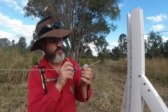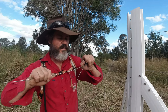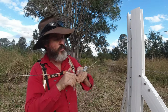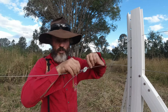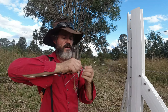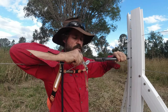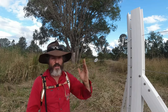To undo that now — like I said, there's three holes: two the wire goes through, and one for the key. You merely push the key all the way in, hold this wire, and the wire comes out. If the wire doesn't come out — remember I haven't strained this yet to the tension I'll require — what they say is to take the pressure off the wire. So you pull this wire out holding the gripple, holding your key tool, and pull this wire out with a set of fencing pliers to take the tension off it, then push the gripple key in and it'll come out easily. With the tension taken off this wire now, you just put the gripple tool in there, push that in, and off comes your wire. And that's it. I'm going to go ahead now and tension all these five wires.